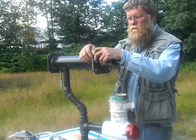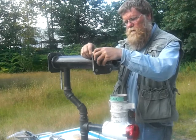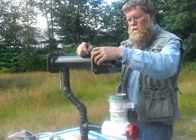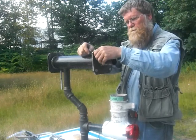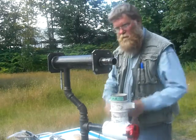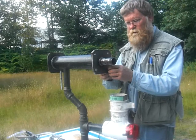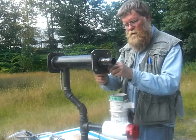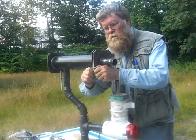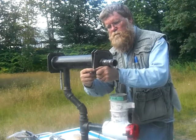There are a few more modifications to do on it. I've already advanced the third generation gasifier and upgraded it to where it can actually crack smoke, but that's going to have to be for another time. In order to do that on this pipe, I would have to modify the inside, which means cutting the welds — so maybe I'll just make another prototype. I have metal-to-metal fittings here where the air and the inside pipe assembly connects; I should probably be using a copper plate or asbestos sheeting at some point.